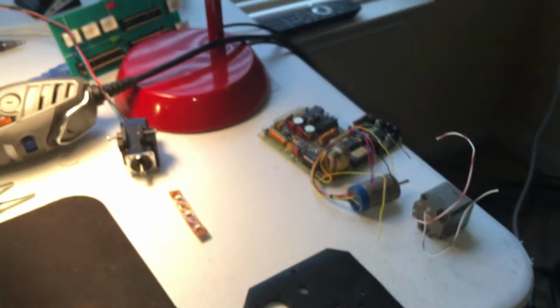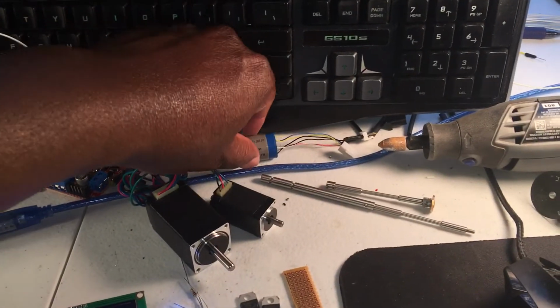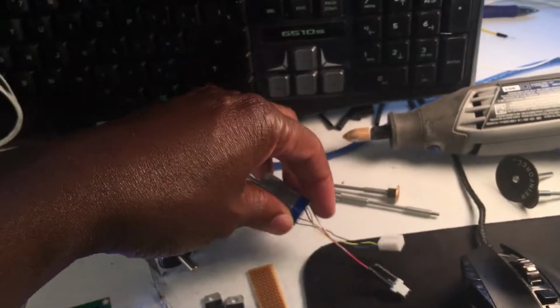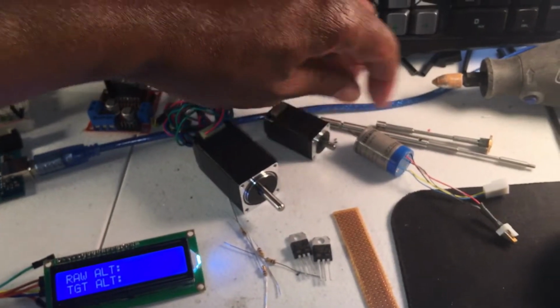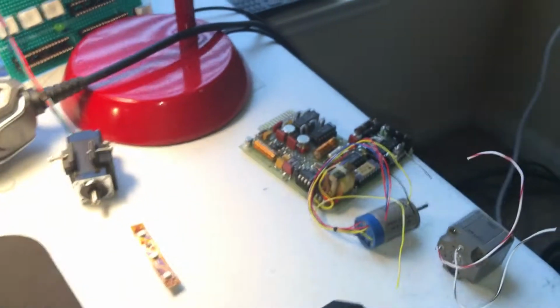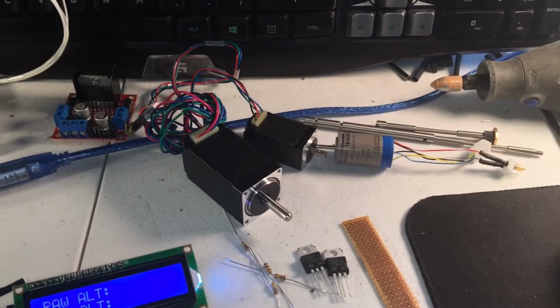So if you go that route, then you would use a synchro transmitter, which would be this guy here. Basically you would have the Arduino, through your driver circuit, your driver board, command the stepper motor, and you would put two gears on these guys, and as this stepper motor drives its shaft, its output signal will automatically drive this resolver. We went over that method with the ADI and HSI. It would have been the same concept, using stepper motors to drive a synchro motor.